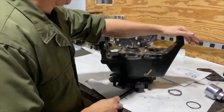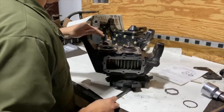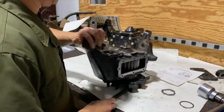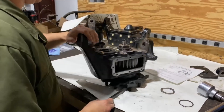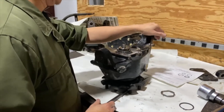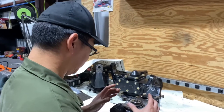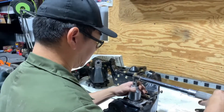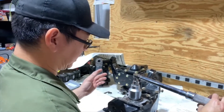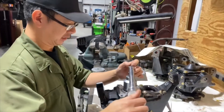1, 2, 3, 4, 5. Now what's going to happen is the bearing is going to seat and there's going to be a little bit of slop that's being taken out. So this is going to move a little bit. What you want to do is repeat the steps until there is no more movement when you tighten it at 40 foot-pound.